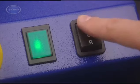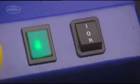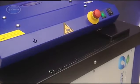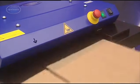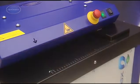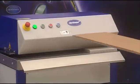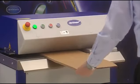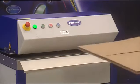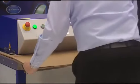The Ecopax range includes new energy-efficient drive technology, powered through a frequency inverter. The benefits of this include compliance with pending EU directives ahead of their compulsory enforcement, quieter and smoother operation for an improved working environment and lower maintenance costs, high motor torque delivering a more powerful shredding action even at low speeds, and a massive 30% reduction in power consumption.